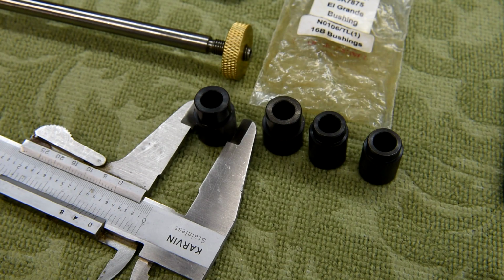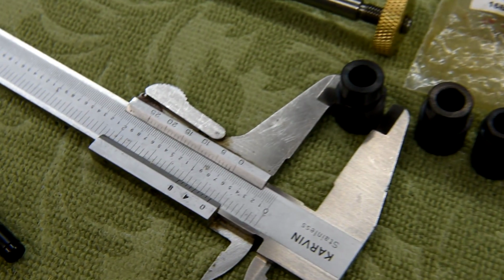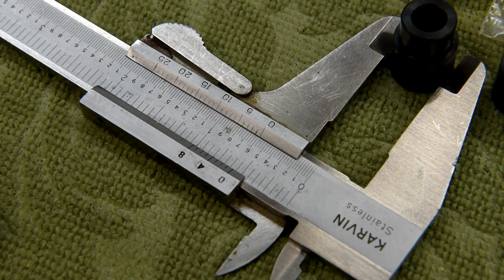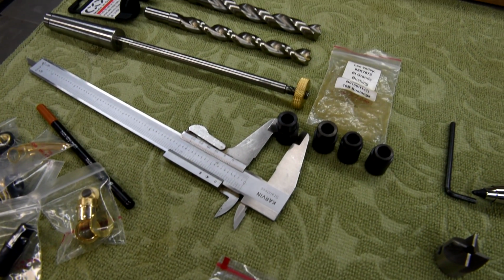Well, I know I got my terminology all messed up there, but I think you know what I meant. Now, this is the first time I've used bushings this large. I do have larger ones, they're for a little flashlight. However, these are the biggest I've ever used on a pen. Here you can see that the one for the cap is going to be approximately 9/16 of an inch at least in diameter, and that will be the smallest part of the cap. I have a tendency to round my stuff over, so it'll probably be around 10/16. What would that be, 5/8?